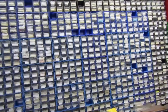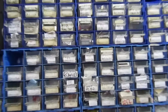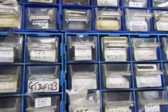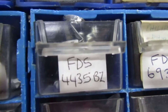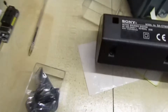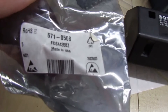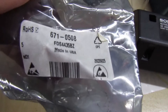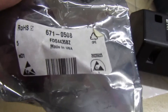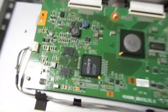Here we go — FDS4435, that's the one. They're supplied by either RS Components or Farnell's — I can't remember which one — but they'll be genuine parts. Rather than take the board out and take it to the hot air station, I'm just going to take it out in-circuit without even unplugging it.